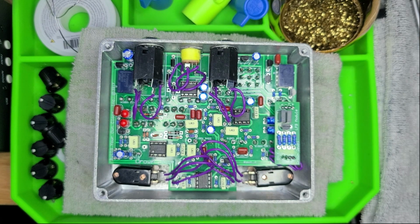And I did. I poured a cup of coffee, and then opened up the back, tested it again, nothing happened. I brought out the input and output jack and the 2 foot switches, plugged in the power just to check, and sure enough, it lit up. So that tells me that one of those 4 components were grounding out. Well, at first I thought it was the foot switches touching the circuit board because everything is beyond crammed in here. But that was not the case.